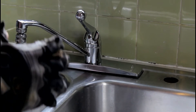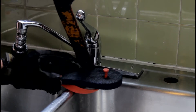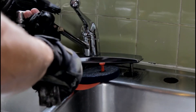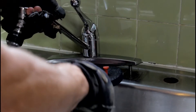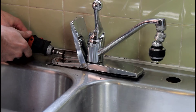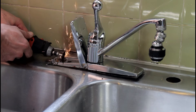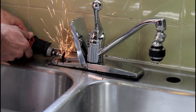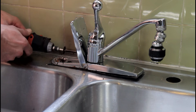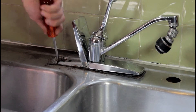It's never as easy in real life as it is in these YouTube videos — there's always some sort of headache you've got to deal with. A real quick tip: if you're using a pry bar to pry the faucet off, make sure you use something soft like a flip-flop so you don't mar the surface of your sink. The problem I ran into was the carriage bolt that attaches the faucet to the sink had loosened up on the top and was just spinning. There was really no way to hold it to get the nut off, and the nut was just seized on there.